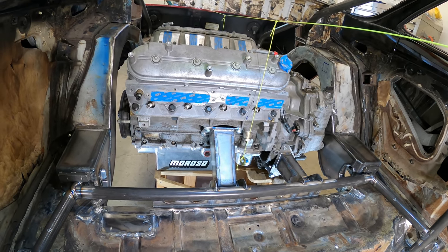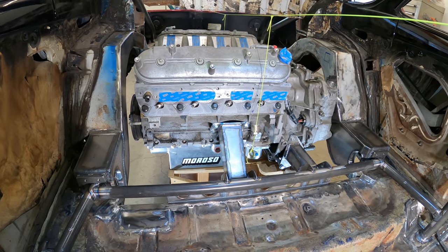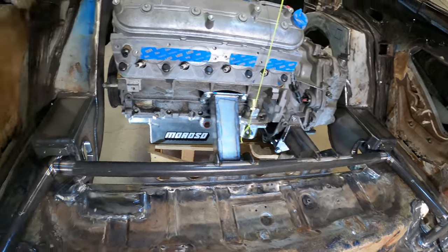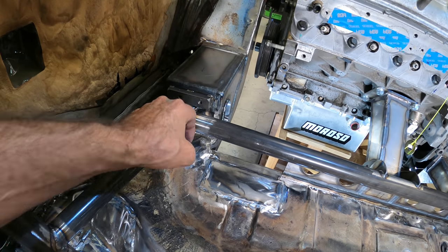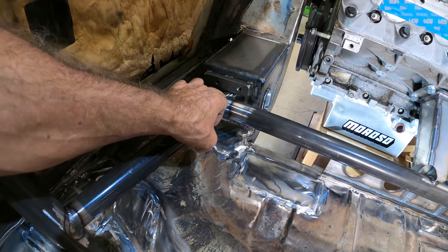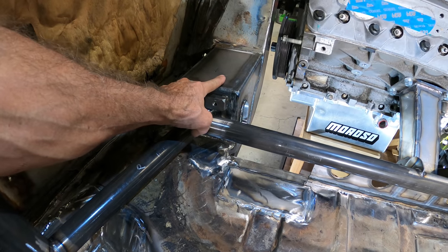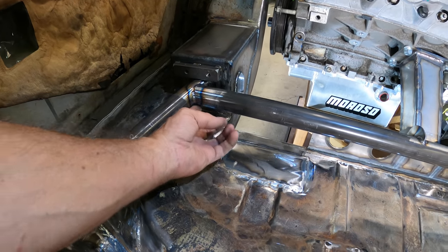And so to begin, this whole thing was to get the motor actually anchored and mounted. And so I worked on the front motor mounts, which started with the cross members, and they are attached to the front of the swing arm boxes, which is attached to the roll bar. The interesting thing about how this is attached to the swing arm box is that I knew I couldn't weld in there, so I drilled a hole in the swing arm box and welded it from the inside of the swing arm box so that I could weld this on the bench all the way around.